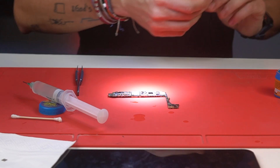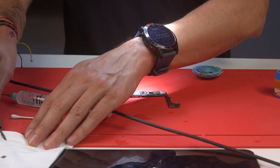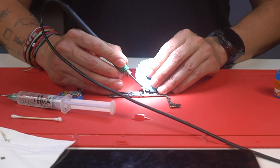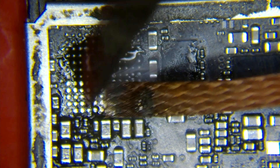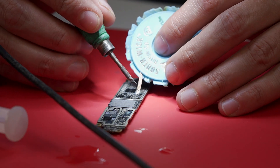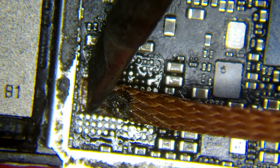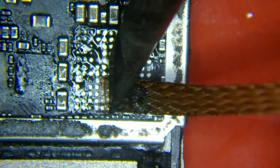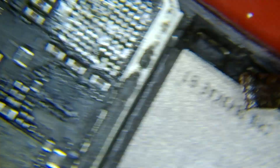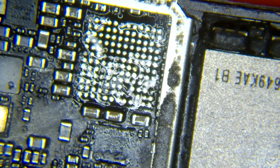We're going to apply some flux and then I'm going to bring the solder wick. I'll leave the iron at 450°C. I'm going to clean the tip of the iron and then just press — without too much pressure — and do it like this. See, easy. I'm going to move my motherboard to be more comfortable to clean the area without damaging anything. Clean here, then move the motherboard and do it like this and this. Easy.